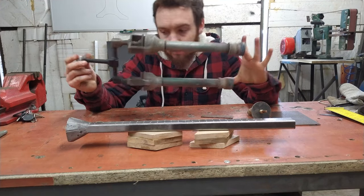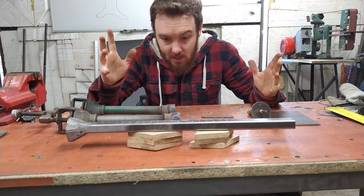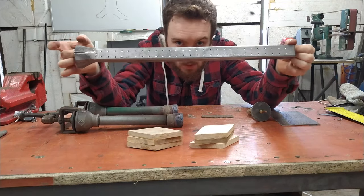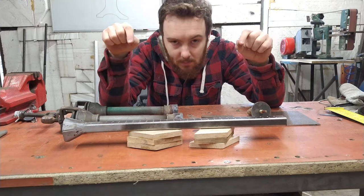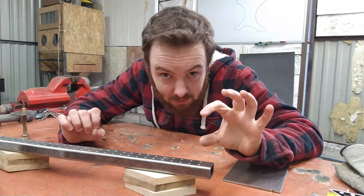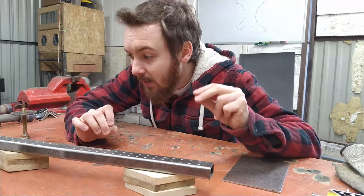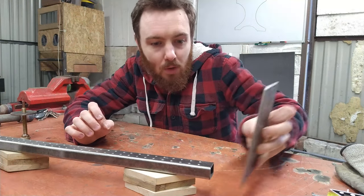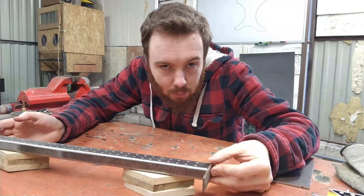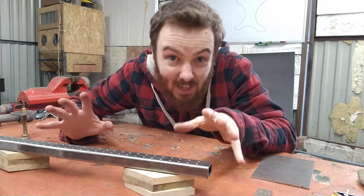It will be very similar to this one, but there is a significant difference between those two burners. First is that there is a flare on my forge burner, and in this one there is a whole bunch of small holes. And because I have never done this kind of burner before, I don't know how big the flame will be, and that is why I'm going to test it before I make a final sample and also a final shape of the covers, which are going to be on both sides. So I will temporarily cover the end of the pipe, try to fire it up and check how it works.